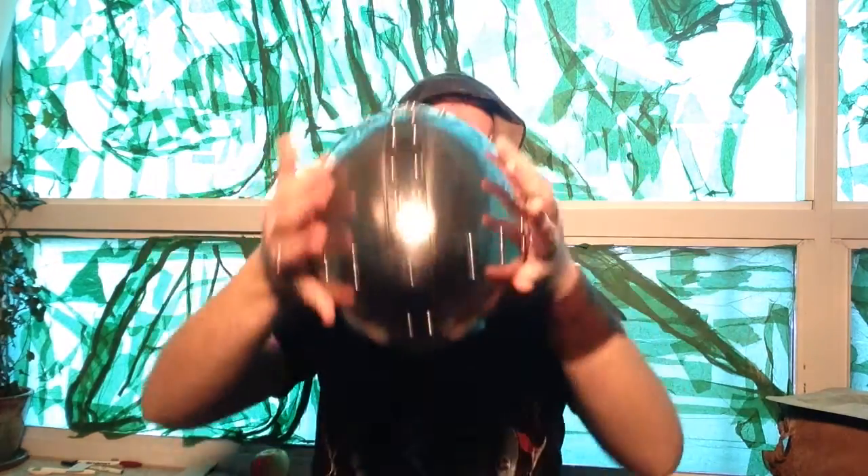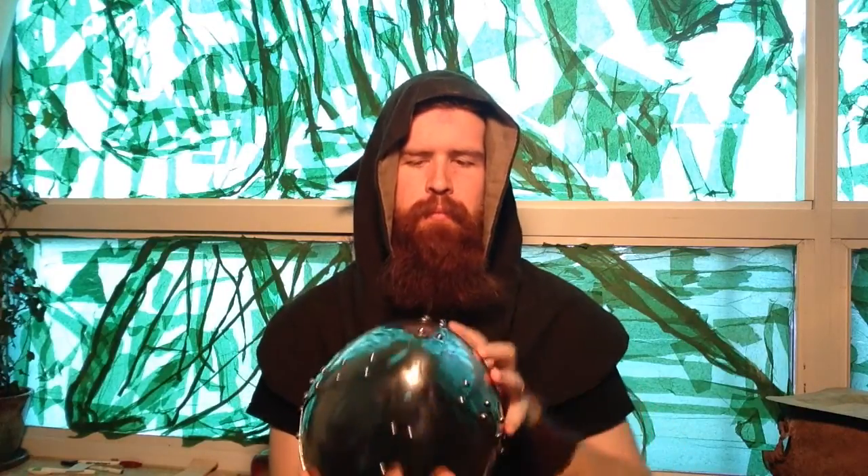It's constructed out of two halves of 14 gauge steel that are both welded and riveted together with the straps. The bottom rim also looks like 16 gauge, which is riveted and then welded around the base and ground. So at the very bottom, for whatever the penetration of the weld is — and I suspect it's fairly deep — it is, for all intents and purposes, a solid piece of metal.